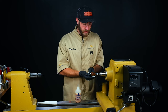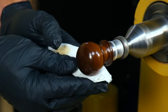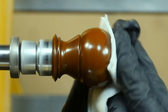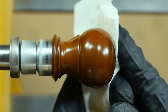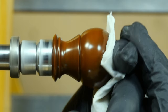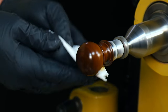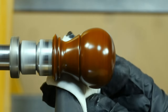The shellac itself is food safe. They actually use shellac to coat food products to help keep them from discoloring during transit and help them last longer. So the shellac is food safe; however, the solvent is not. If you're using this with something that's going to come into contact with food, you need to wait at least 30 days for those solvents to all evaporate. I've switched my rag over to a clean section of cloth and I'm going to friction dry that surface. You can see the gloss level is already almost double or triple what we had from the sanding sealer. I'll flip the rag back to my finish side and put just a little more finish on. We'll do two or three coats, maybe four — you can definitely do more than that, but I'd do a minimum of two to three. The more coats you put on, the more durable it is.